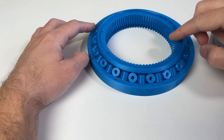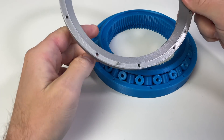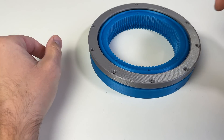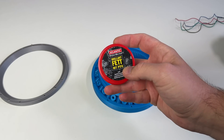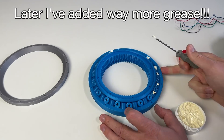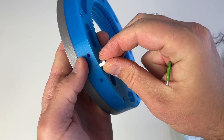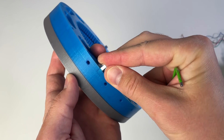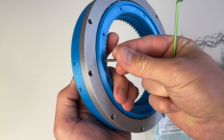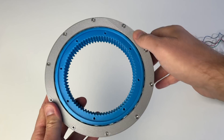To have the best tolerances, I 3D printed all parts on the same printer. To align this ring I used 2×8mm dowel pins. I need to put the grease before assembly — I'm going to use this PTFE-based grease, which I use for all my plastic projects. I'll put the grease first and afterwards put the rollers inside. To fix everything, I'm using 8mm standoffs for M3 screws — I need 10 of them — and 25mm long screws go on the opposite side. I have fixed all the screws.